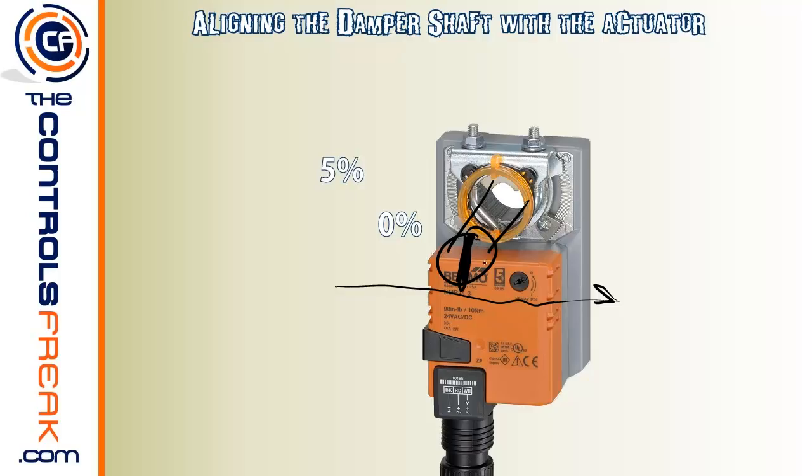And then what you want to do is slide your actuator on there and leave the bolts here loose. Okay, you want to leave those loose. And what you want to use is the clutch. And there's your clutch there. When you push on that clutch, that's going to free up this part of the actuator right here.